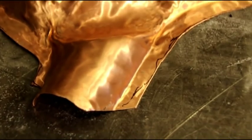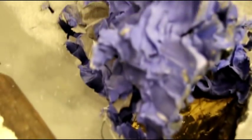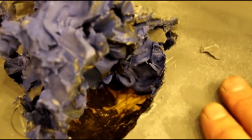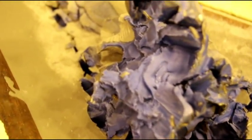I haven't tried to do anything with it yet. I just wanted to see how it was going to press. I think if I was using quarter hard or half hard, it might be better. And these are kind of like a press die. So if we were going to press this, or if we were going to stamp this, and we went to a stamping company and said, hey, make these parts for us, when they made their die, the top one wouldn't just come down and squeeze down on it. There'd be a two-stage process where you'd have your sheet on here, then you'd have a die that came down and completely captured and squeezed the sheet very tightly to the bottom die. That way when the top die comes down, it's actually stretching the metal and flowing the metal into the bottom die. So what I don't have with these dies is that pressure die. I have no way to hold the sheet firmly to the bottom die and then push it and stretch it in there. And I think if I was stretching it in there, I'd have less wrinkling.